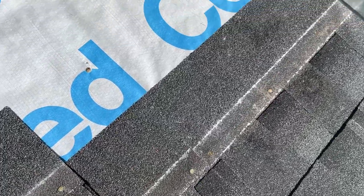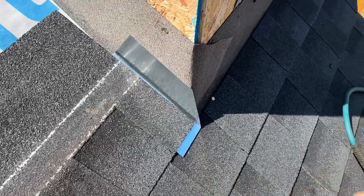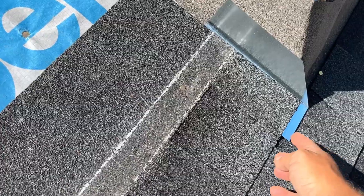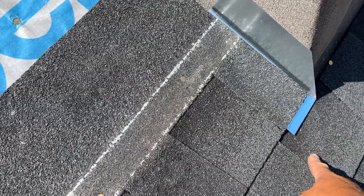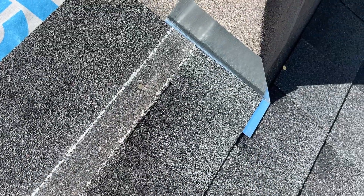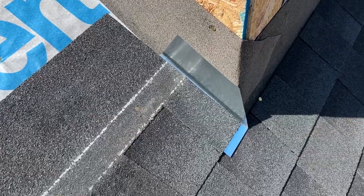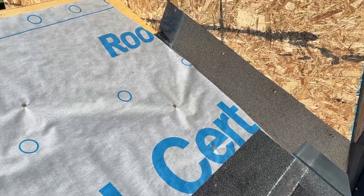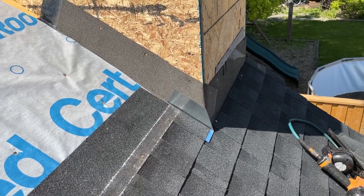What you're gonna notice is that normally there will be a little exposed metal here — don't worry about that, because once we put the flashing on the front and up the side of this chimney it's gonna bury that. We need this so that it drains out on this shingle. Sometimes it works out where you don't see very much, sometimes you see a lot, but once we get that front flashing on and the side flashing you won't see it anymore. Now there's gonna be standard step flashings all the rest of the way up — we have two videos on that, check those out, and we'll be back when we get to the flashing section.